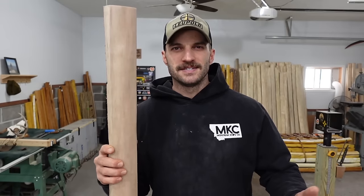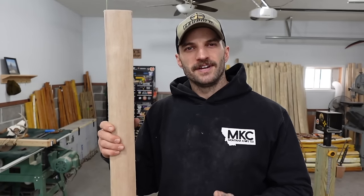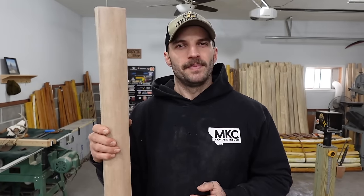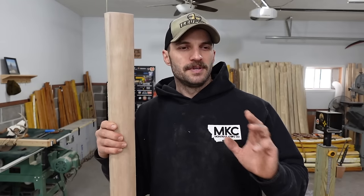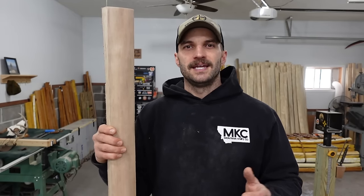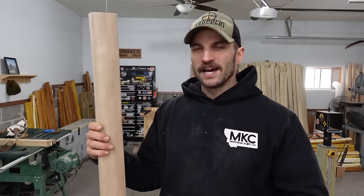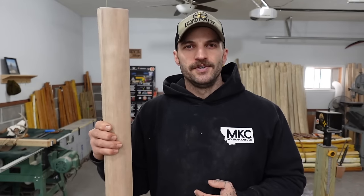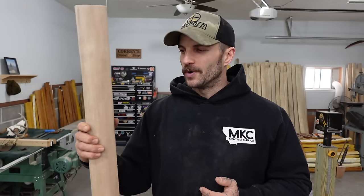Today I'm going to mix things up and show you a simple and effective way to make a primitive bow using none of my specialized bowmaking equipment. So I'll skip the bench vise, no draw knives, spokeshaves, not even a tape measure or a tillering rack. And we will lay out this bow using nothing but the measurements taken from my body, and this will transfer to you regardless of how tall or short you are.